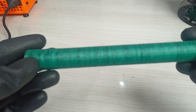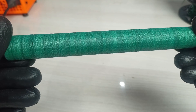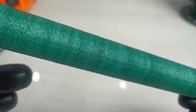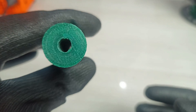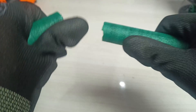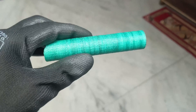A long rod was 3D printed using about 30 grams of filament. The result has a rough texture and uneven surface finish, which is expected since this is agriculture wire and not a standard filament. The bigger issue is that the filament is extremely brittle — if the printed part drops, it will break. It won't withstand even a small amount of pressure.